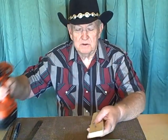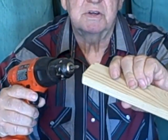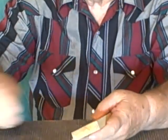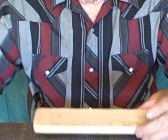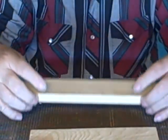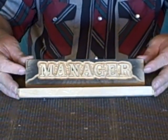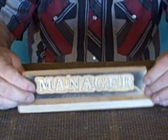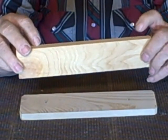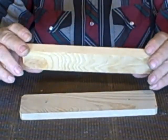I got the holes drilled, and these are the screws. I'm going to use the electric screwdriver to drive those in where they just start to come through. You can just see where it's just starting to come through there — I'll put both of them in. Electric tools are just so much better. Now you can see where the screws are just starting to come through. This is how the sign will fit on there. I hold it and eyeball it so that I've got it about the same at both ends and the same on the side, then tap it. You can see the little points here where the screws are going. If they're slightly off center, I'll adjust that when I drill the holes, but I've got the marks to go by so the holes will line up with the screws.